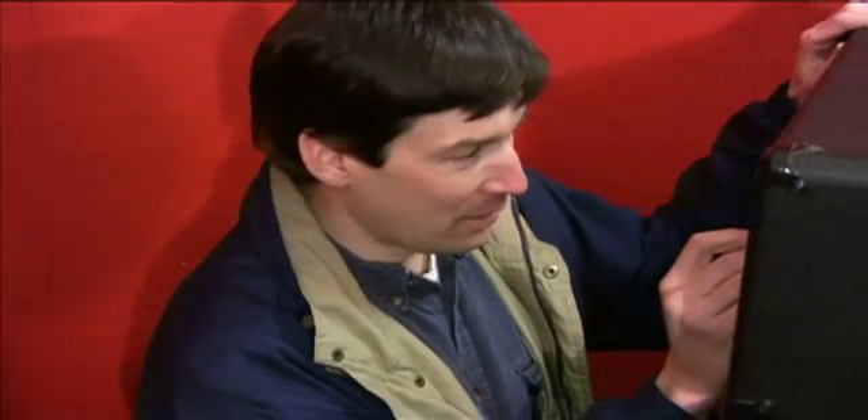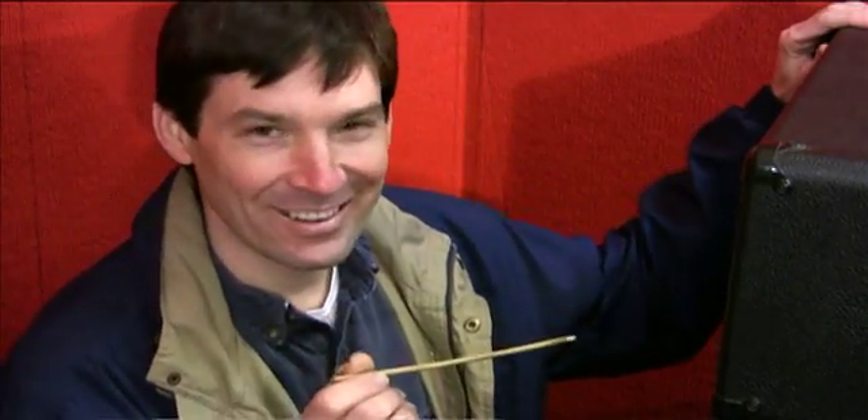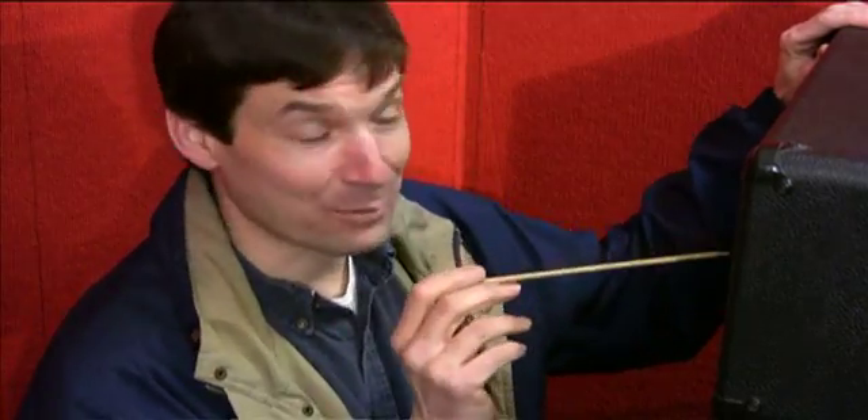Now I can thump it and it may stop or make it worse. If I touch it, I bet it goes away. I can almost make it go — there it is. I'm just touching the glass of the tube and you hear the tone of it changing. It just comes in and out. This is what a microphonic preamp tube sounds like.